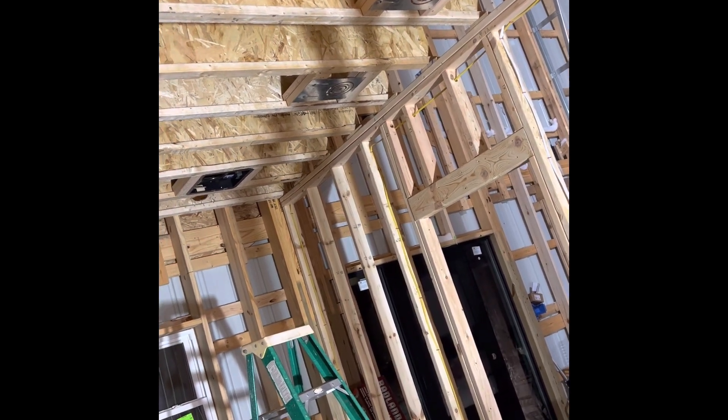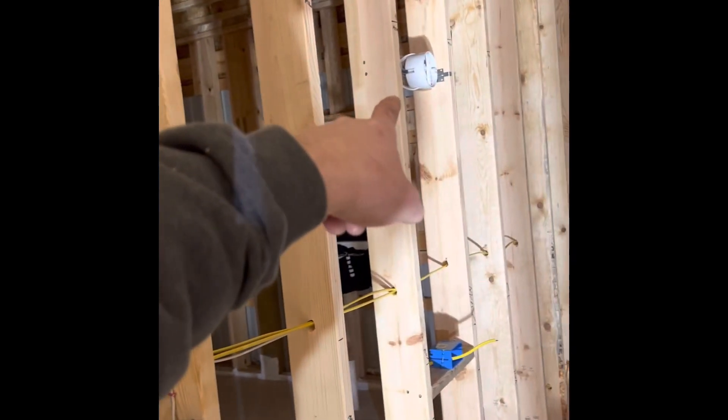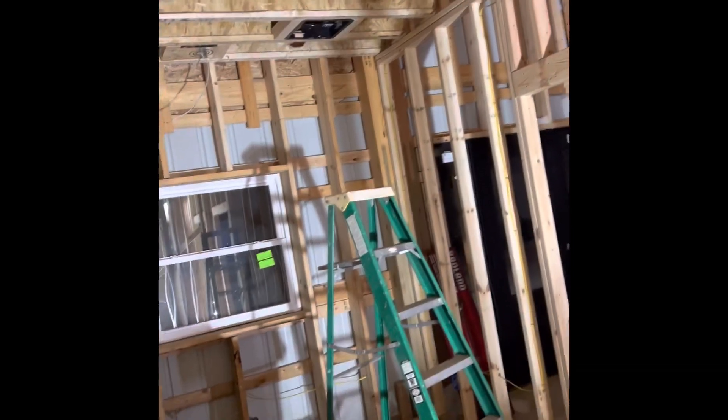For the light circuit — most lights nowadays are LED and very low amperage. So I'm going to have nine lights in here, including the vanity light, on a 15-amp circuit. That would be using hardly anything, maybe a couple of amps even if they're all on. Again, this one's on a switch, so the main power comes into here for that circuit.